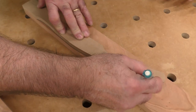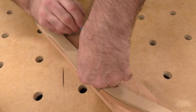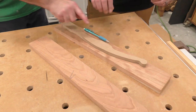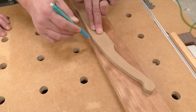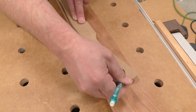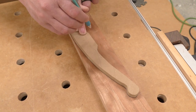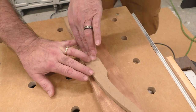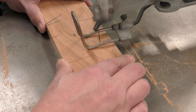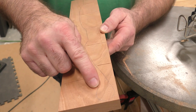I'm just going to draw this out like this and come around here. We are cutting about a sixteenth to an eighth away because the template will clean it all up for us. I'm going to trace one and I'm going to have you trace one. Make sure you bring it down in the corner. My pencil control skills have greatly improved over the years — as I mess it up. Somebody's getting a little cocky. Good job on getting the relief cuts on there. Now what we're going to do is cut the scroll out — I'd probably put one more right here into that notch.